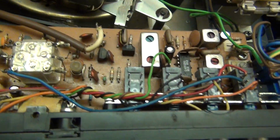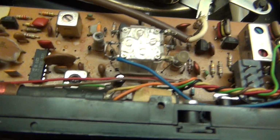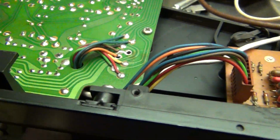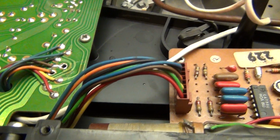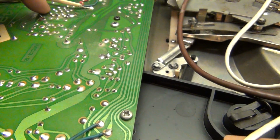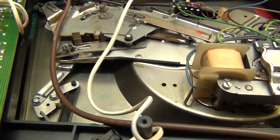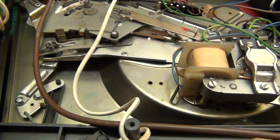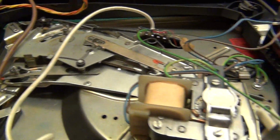But yeah, I'm quite happy now to give that radio chassis a clean bill of health. The main chassis here, the main audio chassis, as they call it, has got a clean bill of health. I replaced this IC here for the cassette preamp. The audio ICs in this have never been replaced. They are the originals. You can tell by the solder that's on them. They are the original ICs that were put in here when this thing was made. But having said that, everything's right on here now.